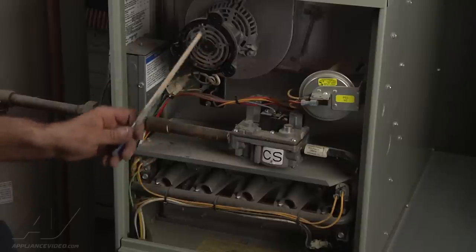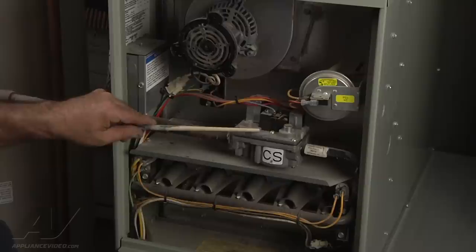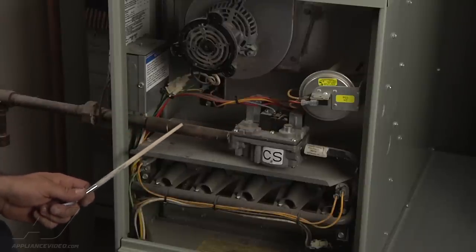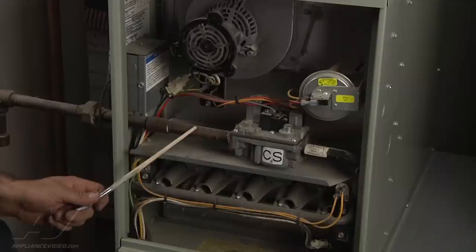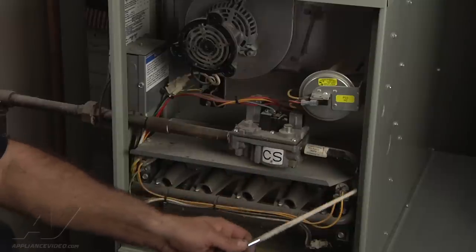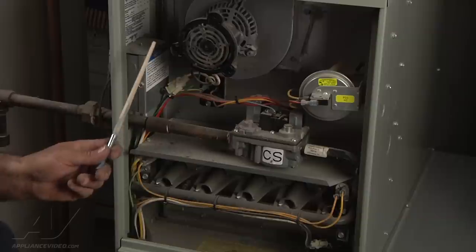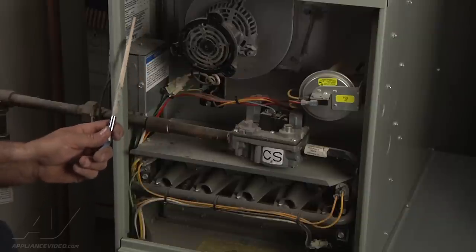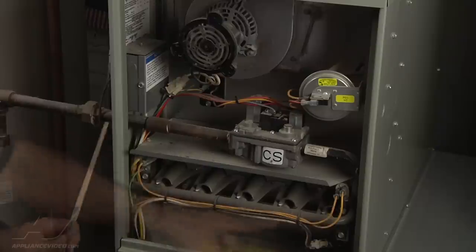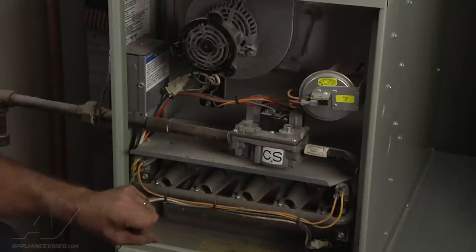This prevents those poisonous gases from backing up into the home. The gas valve has two functions. Its first function is to reduce incoming gas pressure from your gas supplier from approximately 11 to 7 inches water column down to the rated pressure the furnace was designed for. That pressure is found on the nameplate data instruction sheet inside every modern gas furnace, which lists the appropriate pressure that should be supplied to the orifices and burners that we'll be cleaning in a few moments.